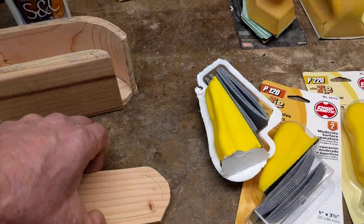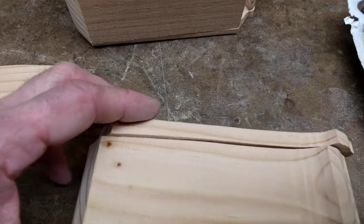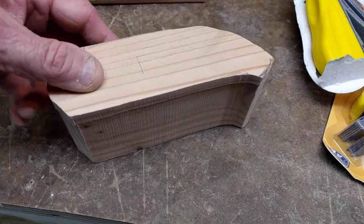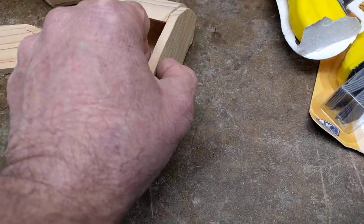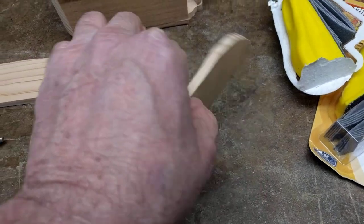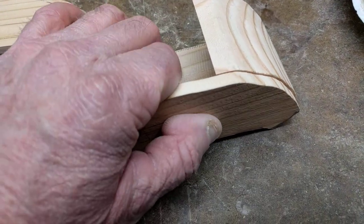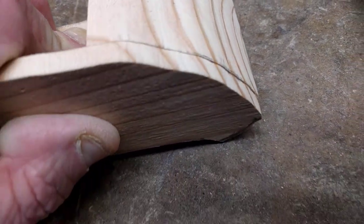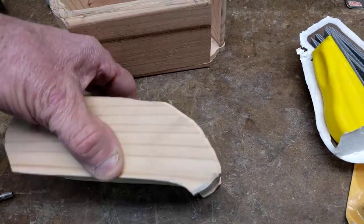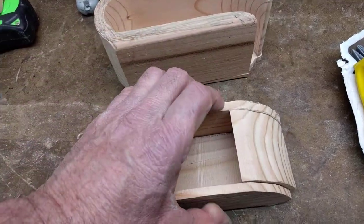You don't want to sand the outer edges here — if you sand there, the pieces aren't going to go back the way they came out of the wood. Right now it's a perfect match because the bandsaw cut them from the wood perfectly. You want to be able to put the pieces back exactly the way they came out so the grain lines up with the grain. If you sand these outer faces flat — as tempting as it is — the grain won't match and line up. You want to fool the eye, and trust me, I haven't shown anyone a bandsaw box where they didn't ask how in the world I made it.